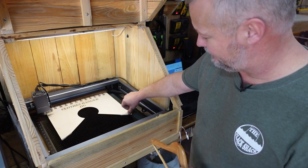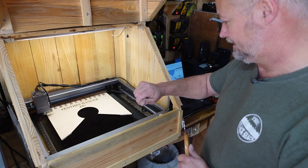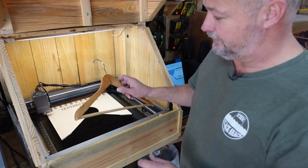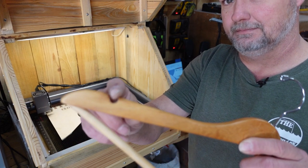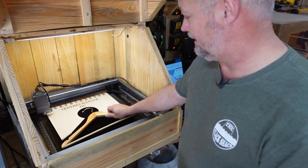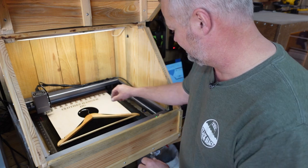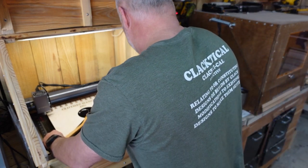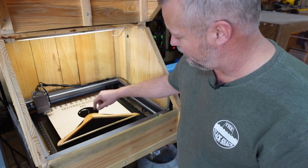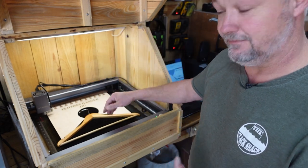If there's any material that needs to be taken off, you can use a jigsaw, bandsaw, handsaw, or if you're using thin enough material, an exacto knife or razor knife to trim it down to fit. These clothes hangers have these little notches. I have timing marks on my jig so that when I lay this in here, the first thing I want is these shoulders firmly up against those two little notches. Then down at the bottom, my lines on the jig line up with the hole in the clothes hanger — that tells me it's square and where it needs to be for the file I've built.